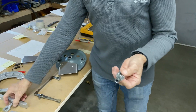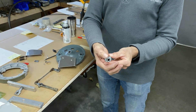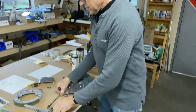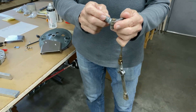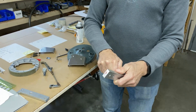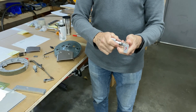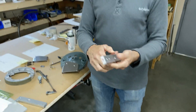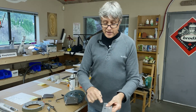These here are the other cams for the brake. I drilled the hole down to about where my thumbnail is, also drilled the hole there — say 42 grams. On the stock Honda brake, these are what I call the brake arms. That's where the spline goes in. So I'm making my own brake arms. I cut a spline — that's the first thing we're going to do today: match the spline. It's a 31-spline, so it really is an odd number of degrees — it works out to 11.613 degrees. We'll go over to the mill and make a spline in this piece of metal to match this spline.